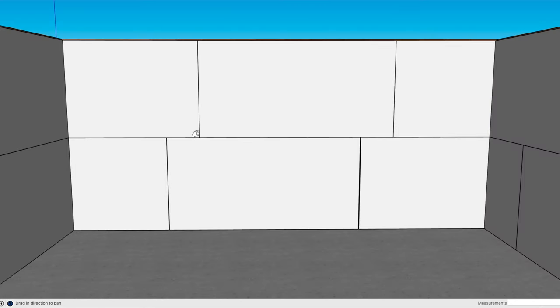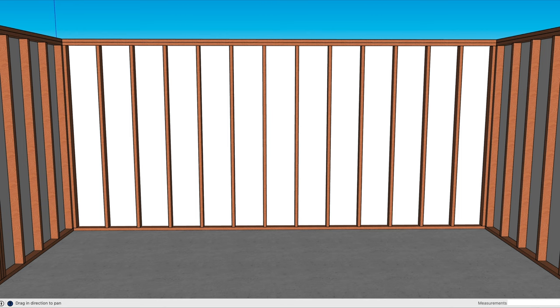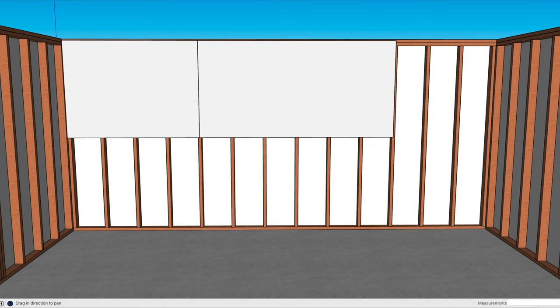The two long sides of the drywall are tapered. This beveled edge is 1/8 inch thinner than the rest of the drywall. Always place beveled edges next to each other. Whenever possible, place your cut edges against the corners where they'll be covered by trim or another piece of drywall. Typically, it's best to hang the top row first and then the bottom row.